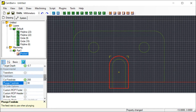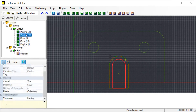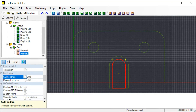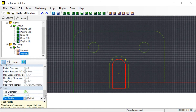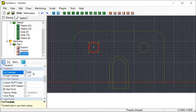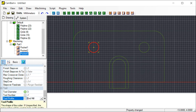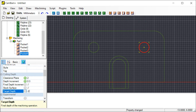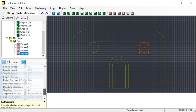Now I'll go through and define the milling operation for each of the shapes. The most common two operations are either a pocket or an outline. I'm going quite slowly and not very deep because it is aluminium and my CNC is not that sturdy. Since I'm using an end mill, I'm going to set a very slow plunge rate. For pockets, I always use level-first rather than depth-first, so I do each level before going deeper. This could probably be done easier by setting up a tool table, but I'm just doing all the settings manually — that's usually how I do it.